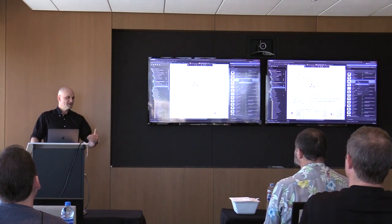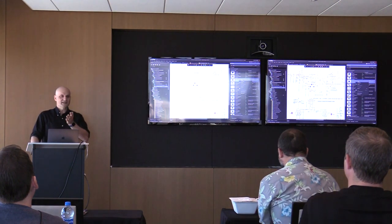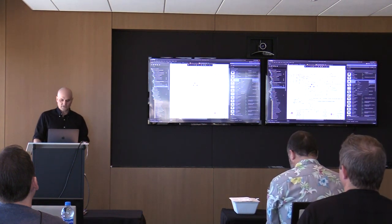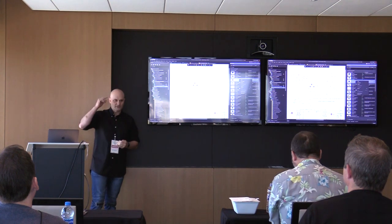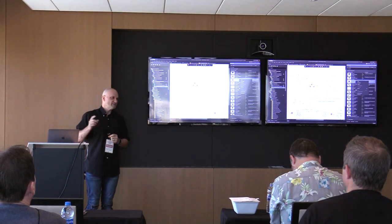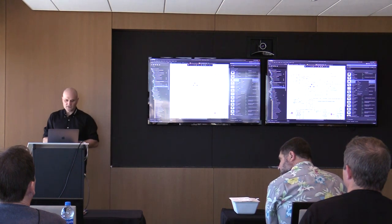Many fastidious PCB designers would do another step to modify the component to meet their own individual specs — that's fine. Or if you trust the Octopart database models, you can place them straight into your design. It's like a central cloud library that everyone has access to. Some of you, particularly Cadence users, are probably using a tool called UltraLibrarian — that was acquired by EMA, the resellers for Cadence tools. They also draw their data from the same Octopart database. The symbols and footprints are different, but the actual component data and supply chain information is the same.